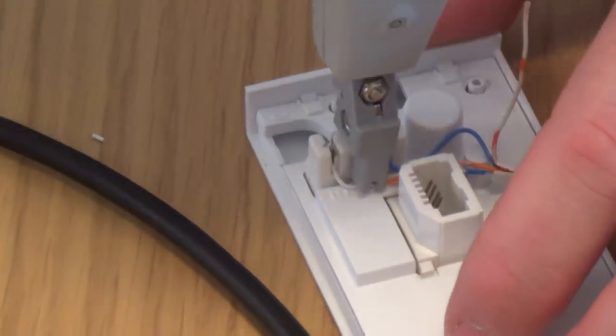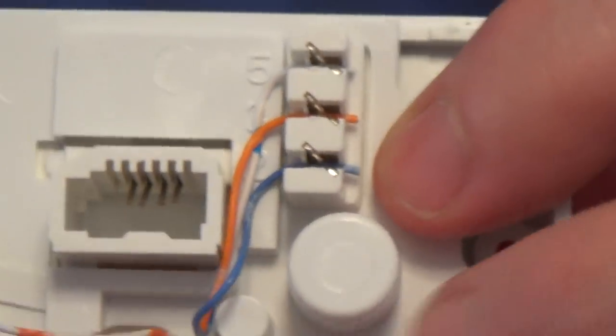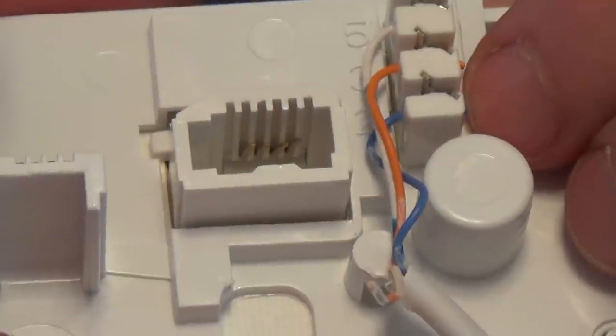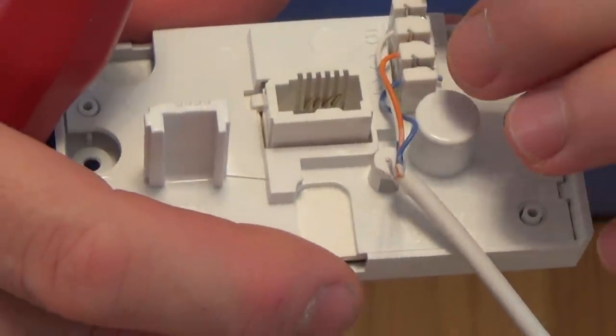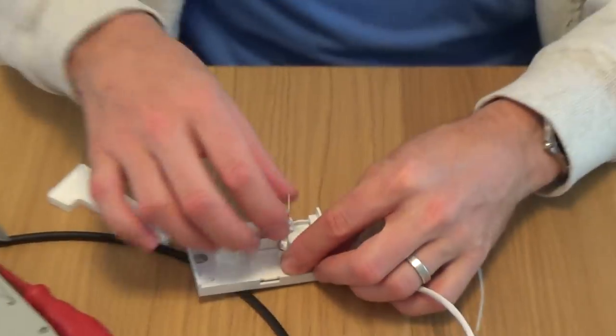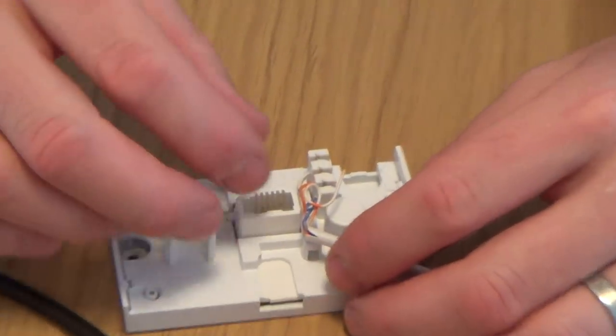If you're using the proper tool, you don't have to cut off the slack because the cutter does it for you. So you've got the white blue to number five, the orange to number three, and the blue to number two. They're all labelled up on the socket. So: white blue to five, orange to three, blue to two. The blue and the white blue make the line work, and the orange one makes it ring - two and five makes the line work, and three is the ringer wire. You're going to have a leftover wire - just coil it up. If you're using three or four pair cable you can have loads of leftover wires; just coil them up and you can use them for another service in the future.